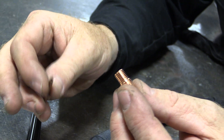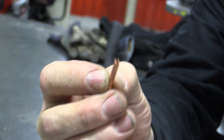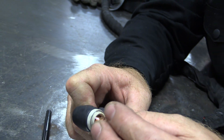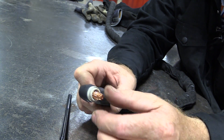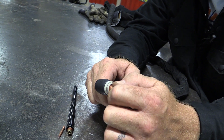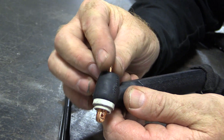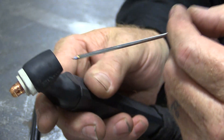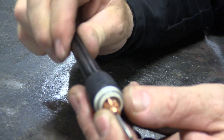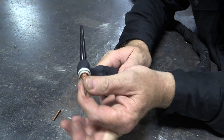So you have a collet body and a collet — this is the new one, you can see the gap is a little better. The collet goes in the collet body. When you put these together, make sure the collet body or gas lens is tight in there. You don't have to use a breaker bar — just do it finger tight. Slide the collet in, slide your electrode in, then put the back cap on. The back cap shoves the collet down into the collet body, pinches the electrode, and holds it in place.